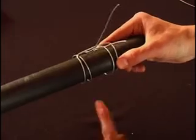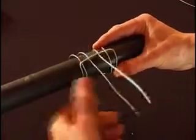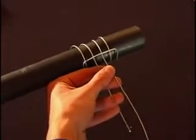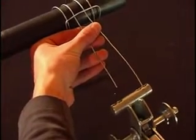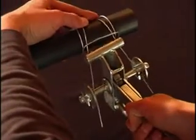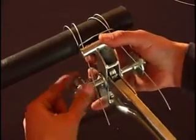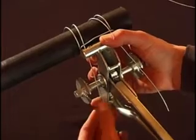Place the clamp so that the crosswise bridge faces upward towards you. Now insert the wire ends through the holes to hold the clamp in place. Hold the Cortool so that the head faces upward, exposing the cogwheel inside. Turn the disc's specially cut notch so that it appears level with the handle, facing towards you.